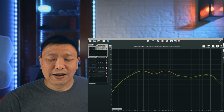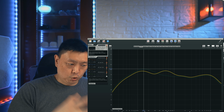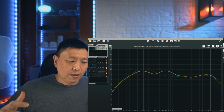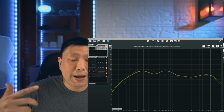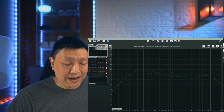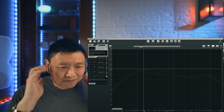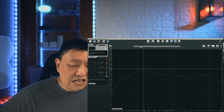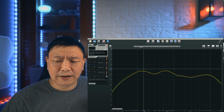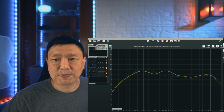You would imagine that the sound is going to be a lot louder, but actually that is not the case, because this particular Sony speaker actually detects that you are trying to increase the volume beyond what the driver itself can handle. And bear in mind, at 50% volume, this speaker is already plenty loud. I was sitting within 2 feet of the speaker when I was doing the testing, and I had to block out the sound a little bit because the test tone was getting a little bit too loud. So the speaker detects that it is way too loud, and it tries to pull down the frequency so that the amp's parameters and the driver's parameters are not breached.